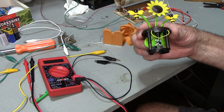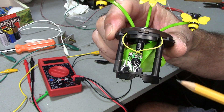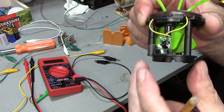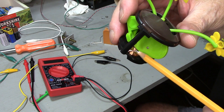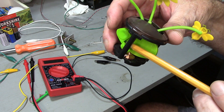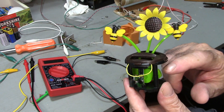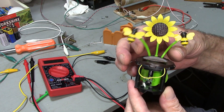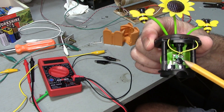The way these little electronic flower pots work is there's what's called a kick motor or pulse motor in here. There's a small circuit underneath this blob that takes the electricity from the solar cell and charges up this capacitor. When the capacitor reaches a certain charge, it'll pulse a current of electricity into this coil. And that coil will kick a magnet that's in the base of this bee away. Now only this bee is connected to it. The other two have a linkage and they are of a certain length and weight so that they become physically resonant, so that as it starts pulsing, each pulse will add to the previous pulse.